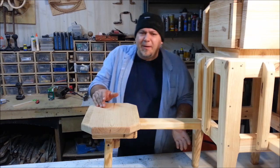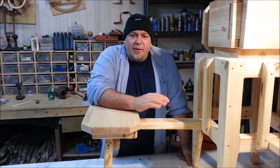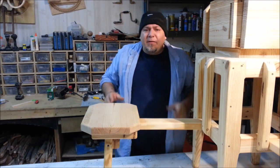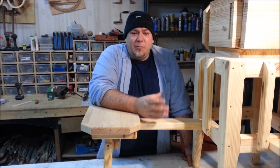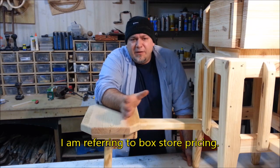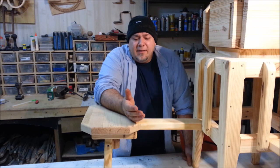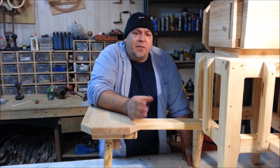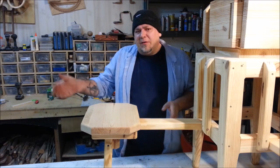The way this is designed, you can build the whole thing — provided you buy material from the box store — for just a little over $60. That includes the screws, the glue, the hardware, everything. It doesn't include a finish, so if you want to add a finish that would be a little extra. The plans are laid out using 2x12s as opposed to 2x6s or 2x4s, because it's cheaper — you can buy one 2x12 for less than three 2x4s. Typically out of 2x12 stock you get higher quality material with fewer knots and straighter grain, because 2x12s most often come from larger or older growth trees, giving you denser, better quality wood.